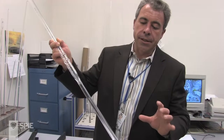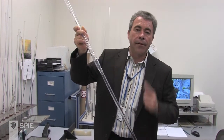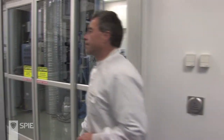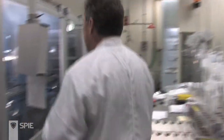The next step is to take the core rod and assemble it into what's called a cladding tube, and that happens in the clean rooms. We're in an airlock right now, and we're moving into the actual over-collapse machinery room. Here you have two over-collapse machines where the core rod, which we saw before, gets installed inside a tube on a giant lathe.